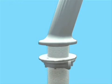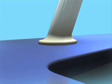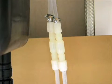The faucet base is designed to mount to a standard 2-inch deck or wall mount opening and is supplied with a sealing gasket and mounting ring. The supply and return lines are fitted with pre-flared tubing and flare nuts and an emergency shutoff clamp.